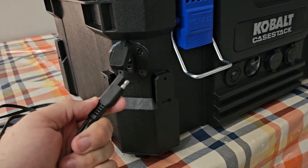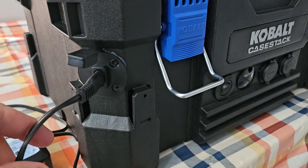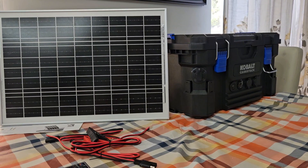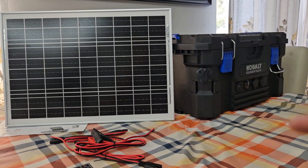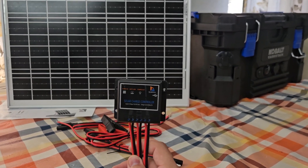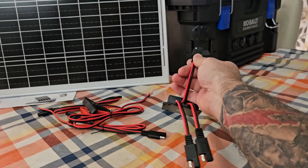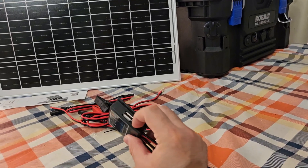The most important thing is making sure the connections match up to the battery — negative to negative, positive to positive. When charging, you can monitor your voltage on the display. I also want multiple ways to charge: a battery tender plugging into the wall, and a 30-watt solar panel with a solar charge controller. From the controller we plug into the solar panel, then from the controller to the battery pack, with an extra connection for other things and a USB power output.